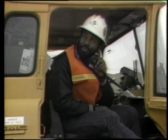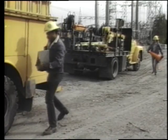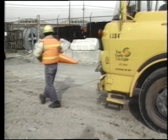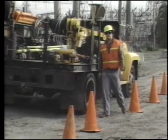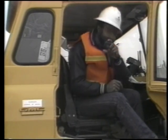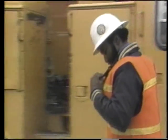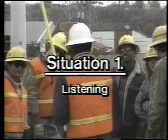Power dispatcher, power dispatcher — 108, 108. This is Durham. We have hold opens for you on the southwest corner of Diagonal Avenue South and 2nd Avenue South. This is Powell — I understand I have hold opens on the 26 kV line. Having a hold open on the line is a safety precaution. It means that if an energized line short circuits or falls, electricity will instantly stop flowing through it, hopefully preventing injury to anyone.